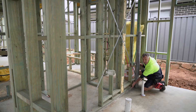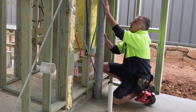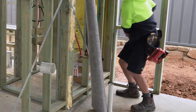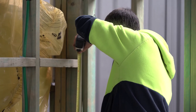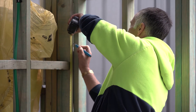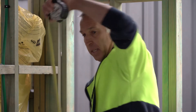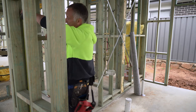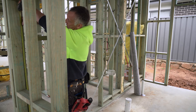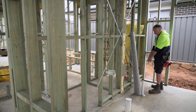It's worth doing — you do this once, you do it right. This wrap is 1500 tall. I'll measure on either side from the bottom plate 1470, and do the same on this side. That means I've got 30 millimeters of overhang on the bottom.